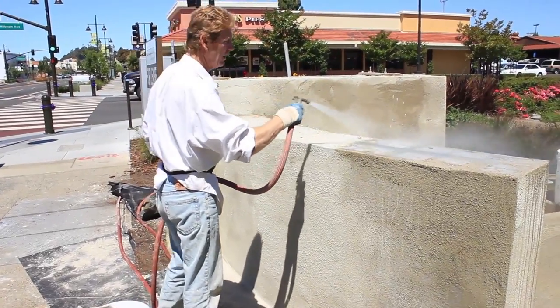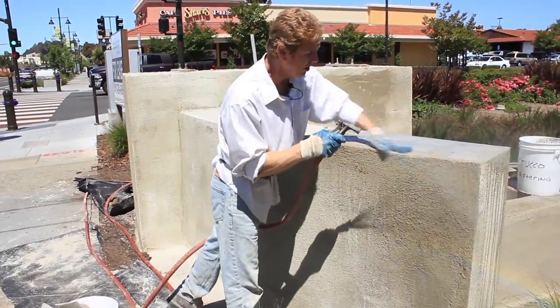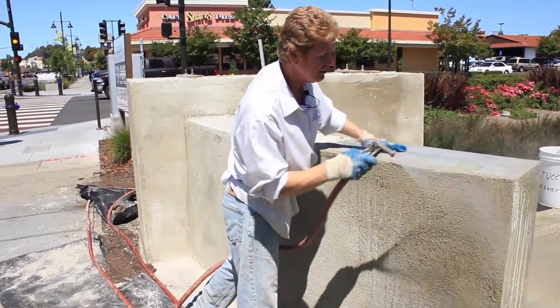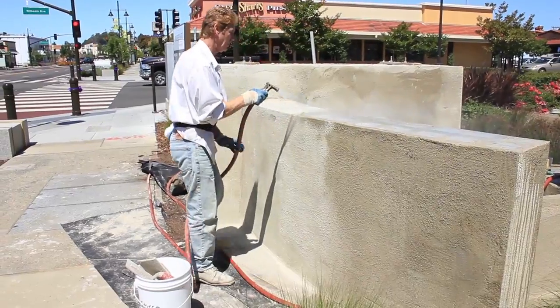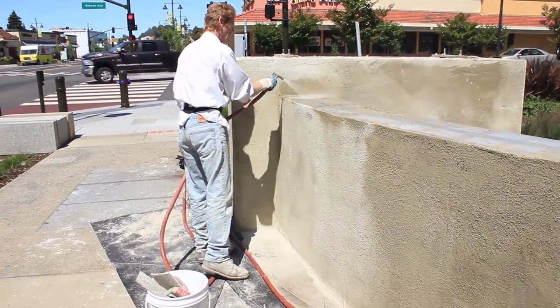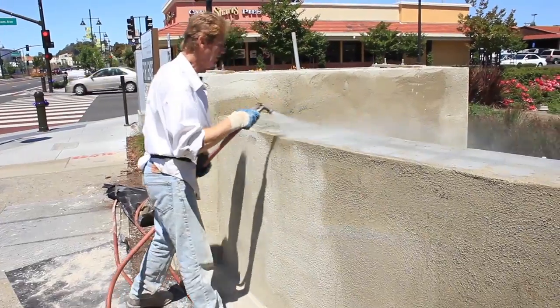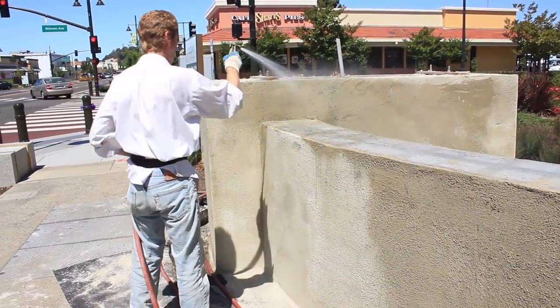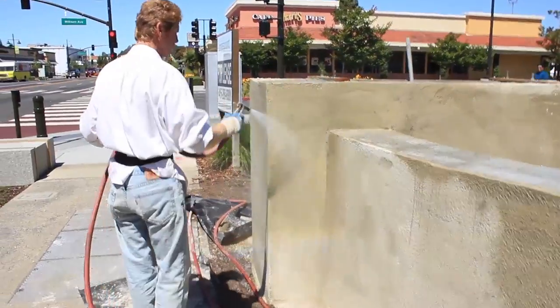What I'm doing now is I'm hosing all the stuff off the top here, hosing it all down. I'm strengthening the stucco. I'm wetting these walls. It's called hydrating it. You can call it hosing it down, you can call it whatever you want. Its technical term is hydrating. So we hydrate this wall, over and over, we get all the stuff off because